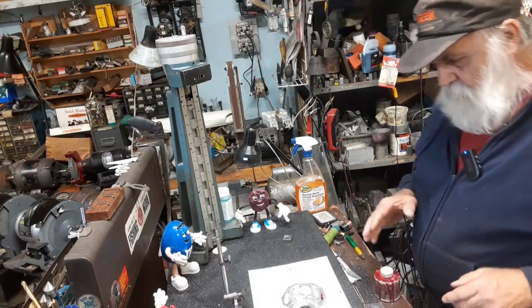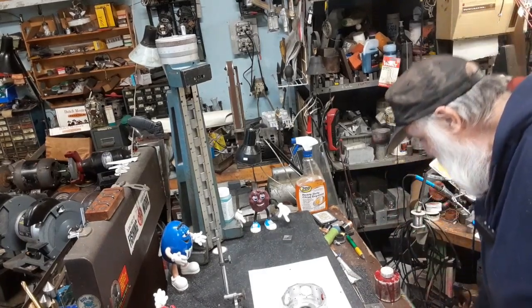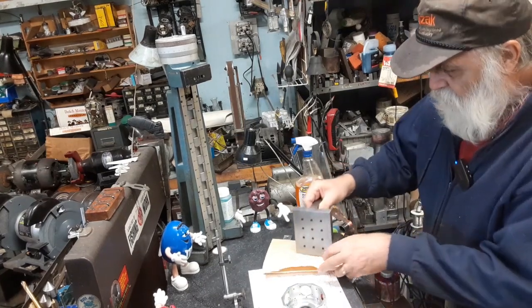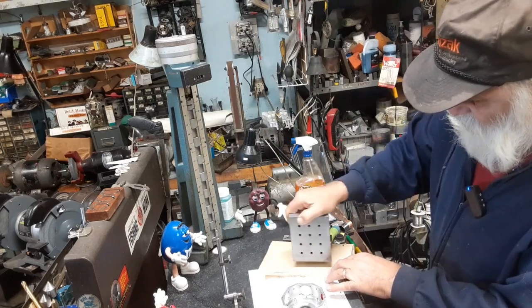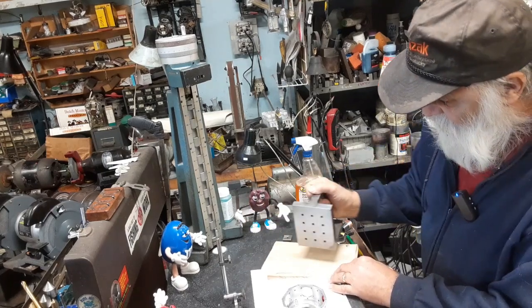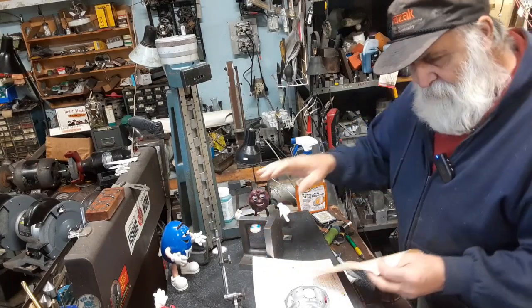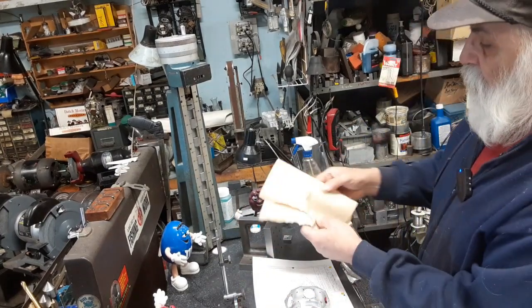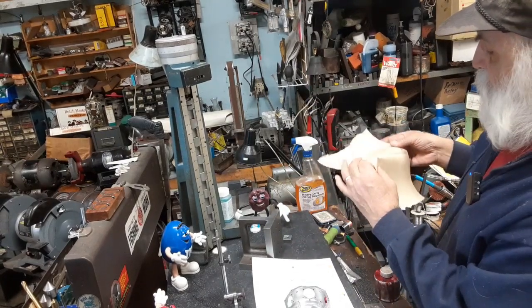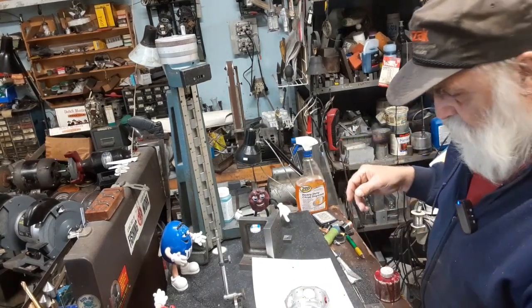So I need to set it up at 25 degrees first. So I'm going to have to get one of my knees out here, because we're going to have to bolt it down on a knee. I'm going to rub the bottom here to make sure that she's clean. I just cleaned my surface plate and I didn't want to put crud back on it right away. That's how, if you got a high stand or something that you're going to put on your surface plate, put a piece of clean paper underneath it and then slide it off. That'll wipe it all nice and clean.